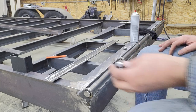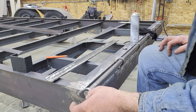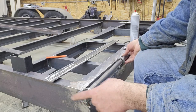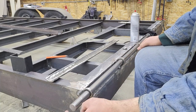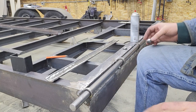So I think what I'm going to do is take a scrap piece of the 1 inch. I'm going to drill the 5/16 hole, actually smaller than that, the appropriate size hole for tapping. Drill that through that slug, and then I'll just extend this out and use a piece of a V-block to clamp that on there and use that as a drill guide. That'll help hold that directly centered.